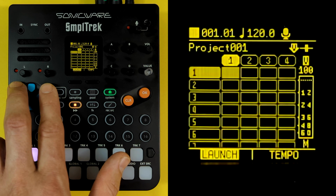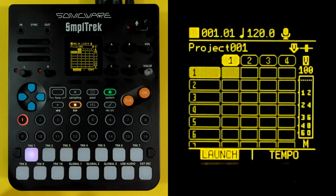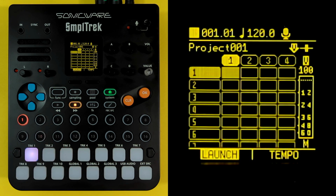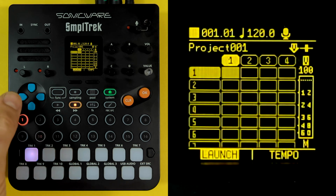We've got these two volume knobs here that are for turning up and down the signals coming from the external audio inputs on the back of the device. There's also a couple of red clip lights. So if you're seeing these lighting up, that means we're going over the threshold at the maximum volume that it can record, so we need to turn them down.